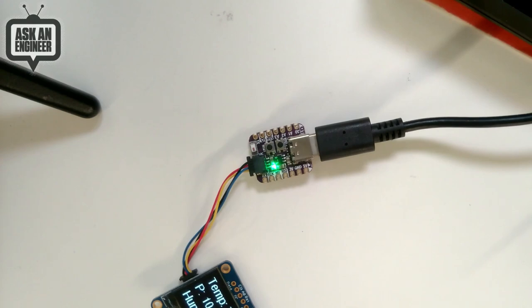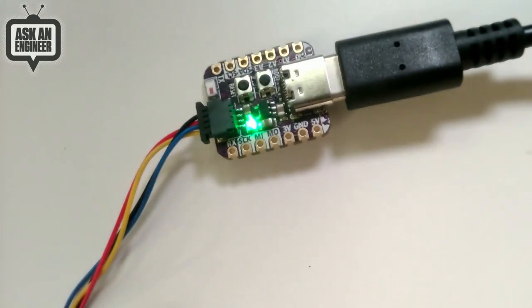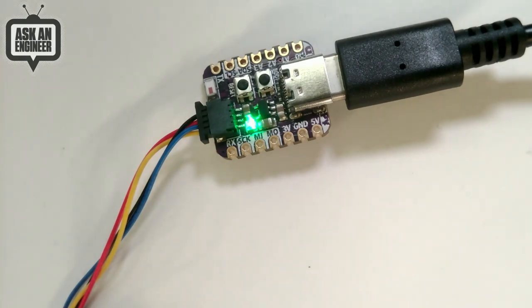It is a totally new chipset, and while a lot of stuff worked, for example, for Wi-Fi to work with the native USB to serial converter, I had to be on the master branch. You can't use the release, you need the latest commit. The release has a bug in it. So this is kind of for people who want to experiment. I wouldn't necessarily get this as your first microcontroller or even first wireless board, because I think you'll go a little nutty if there's a bug and you don't realize it.